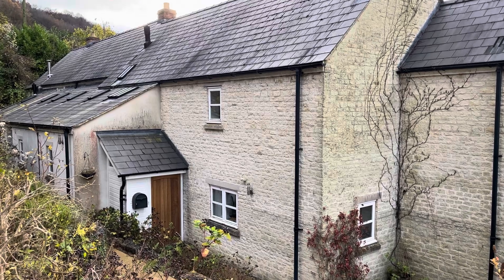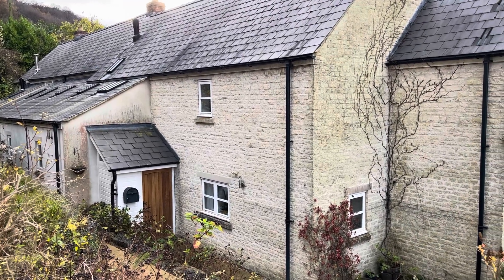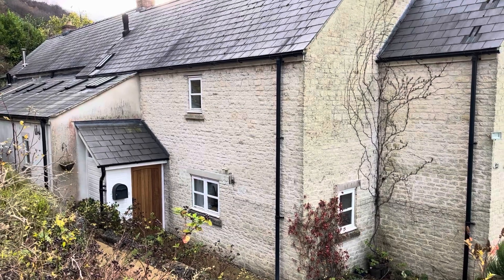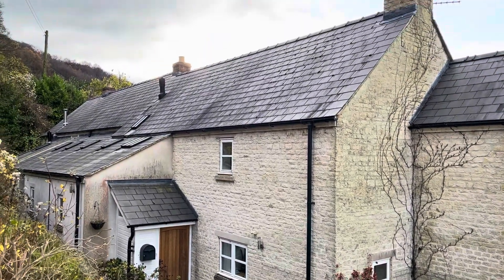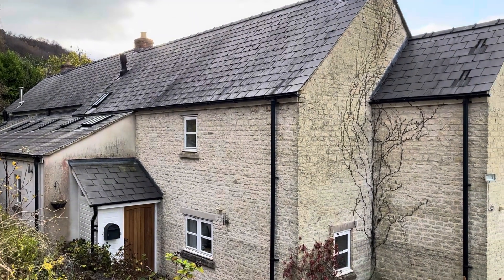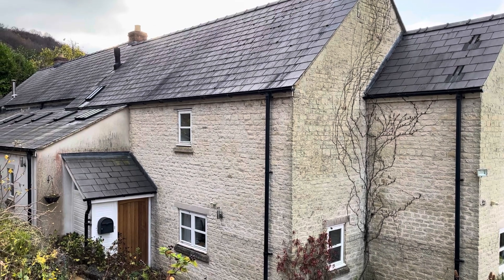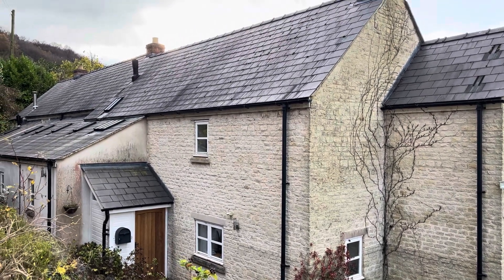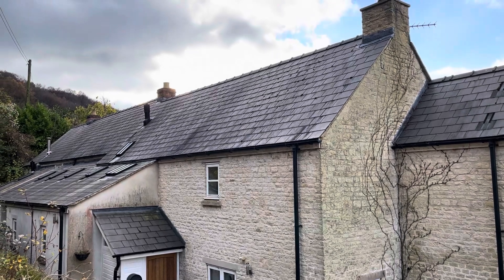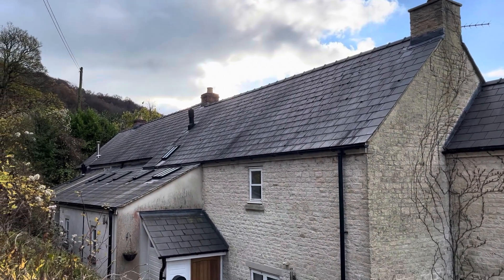What I'm going to try and do now is install an MVHR system to keep air circulating throughout the house, also to get fresh air in which I'll get in from the roof. It also does a heat exchange on that fresh air coming in, so the hot air going out exchanges heat with the air coming in and you don't lose much heat at all. I'm hoping that's going to improve the air quality whilst having all the insulation benefits of all that draft exclusion.